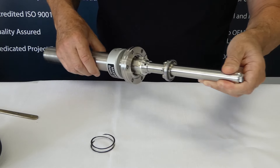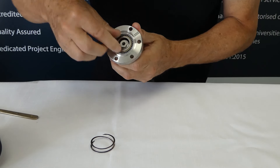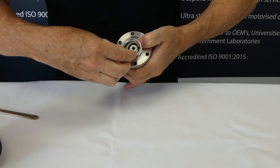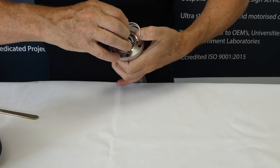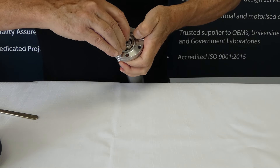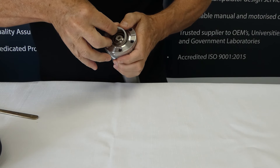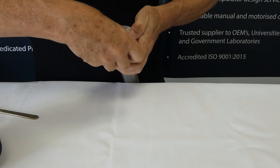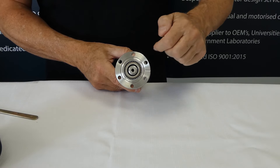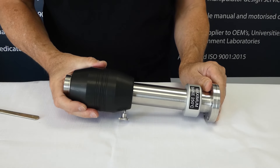Just to put it back in again — make sure that is fully in. Once the bearing seats down you can put the clip in. The clip just goes into the start of the groove, and once it is running in the groove it will run round. It is a bit fiddly — you wouldn't believe how many times I have done this. There, that is in and the bearing is now held in by the clip. Put it on the table, put the magnet on making sure you have got it the right way — first set of magnets, second set of magnets.